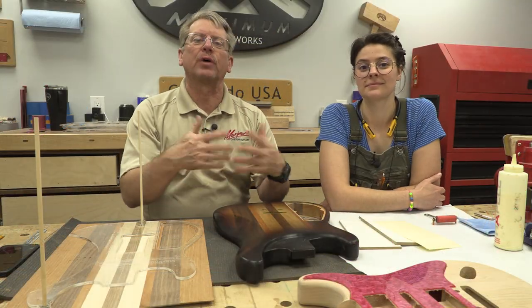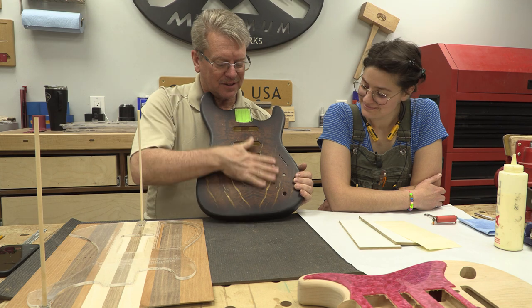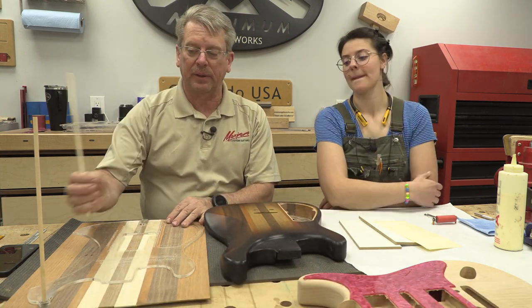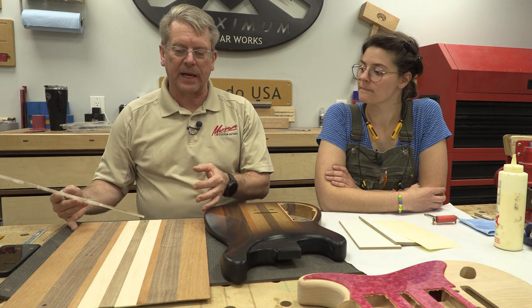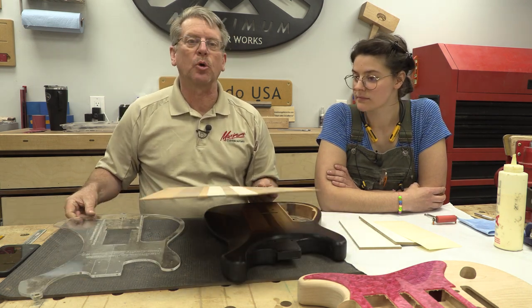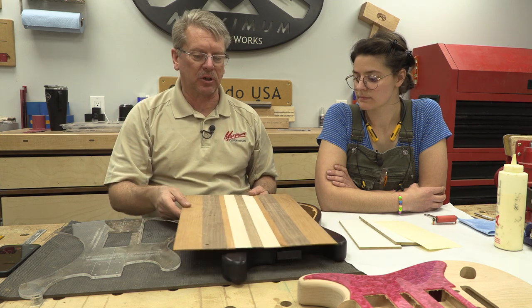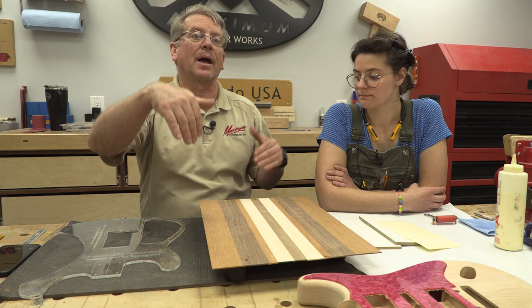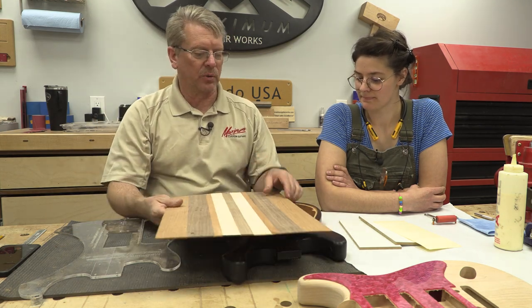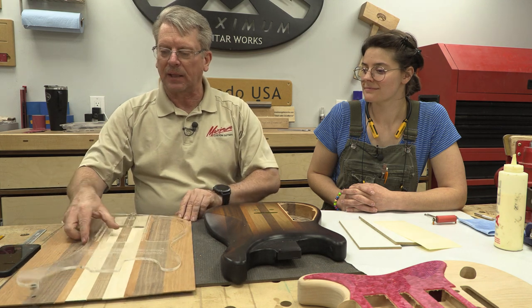All right. Last thing we're going to show you in the realm of pickguards is doing the control cavity cover on our environmental series. Fractured, filled, beautiful claro walnut top. We're going to make this match. We talked about it a little bit in the earlier discussions, but here's how it goes down. So I sliced this off. It had the alignment pins and those locations in place. If you do any of this type of stuff where you slice a layer off to reuse it for a cover plate, you have to make sure the orientation stays the same. So I drill those holes at the same time it's still connected to the block of wood. That way I can't confuse it and get it backwards. And so this is how it came off, and this is how it's going to set back in, and that'll be perfect alignment.